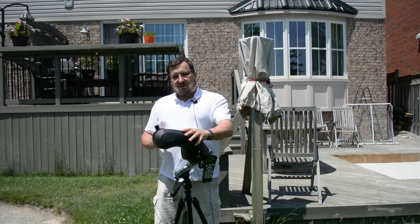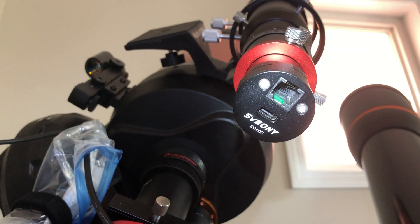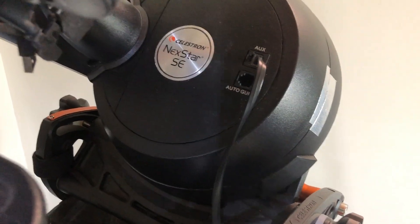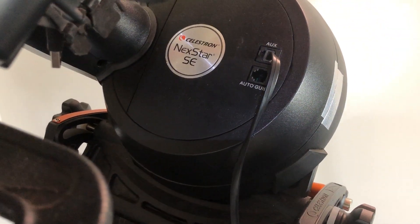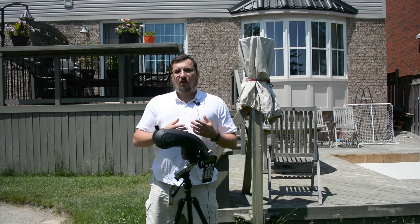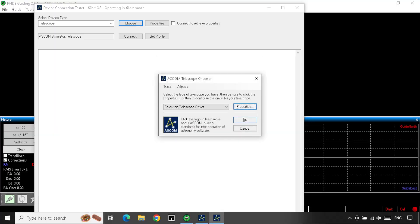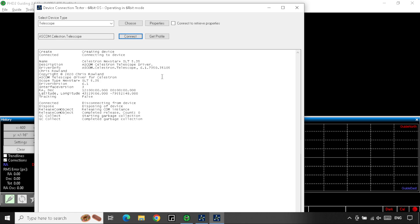I was trying to connect this mount using the AUX port to my guide camera, such that my guide camera would be able to pick up signals and send signals to the mount. It turns out that's not what this AUX port is for. Many mounts have specialized guide ports and or specialized AUX ports which can also be used for guiding — that is not what this AUX port is for at all. It is intended for Celestron accessories. Having installed the new Celestron ASCOM driver, I found that I could connect the controller to my laptop using the USB cable and the ASCOM driver recognized the mount.